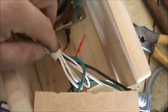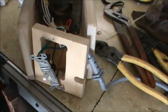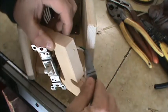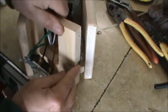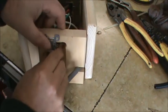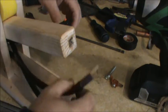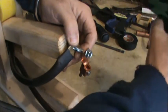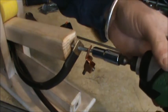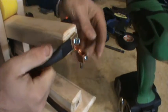I've taken all the longer loose wires and secured them with a wire tie, and worked the outlet through the opening. The last step is to run the salvaged microwave cord through the opening on the end plate and secure everything in place using screws. For the ends, I'm using copper lug terminals — connecting the wire right to the end and securing that using lag bolts.